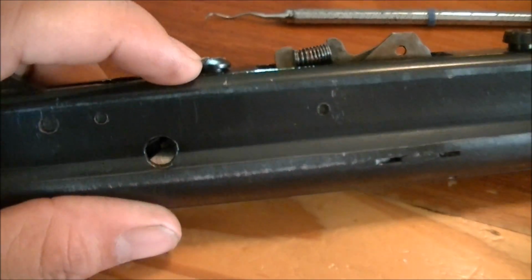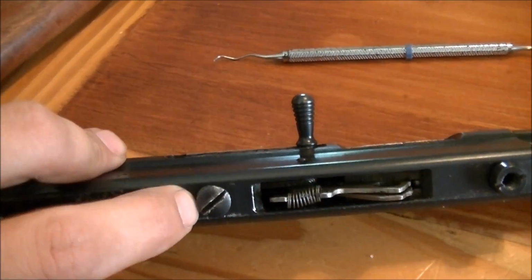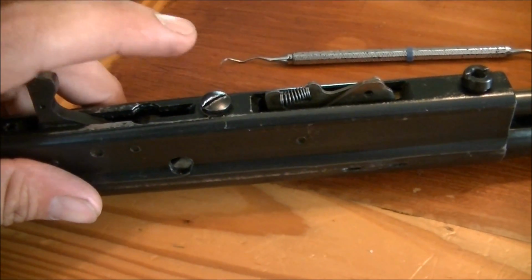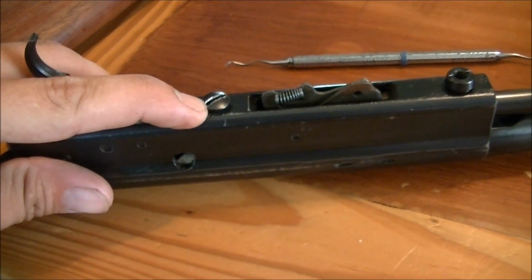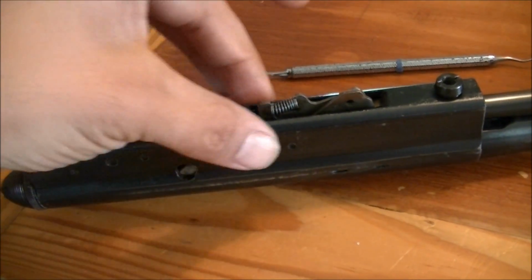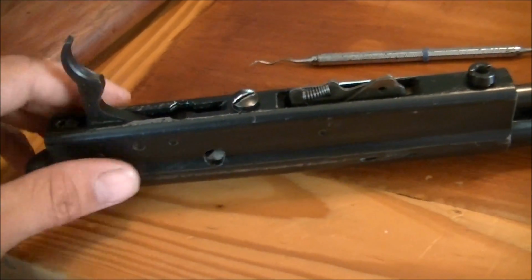I've got this tightened down. I actually lengthened the spring just by a hair to give it a little more pressure to push on the sear. So that's one thing, my honest opinion is leave that alone, because I guarantee you, unless you are very, very careful, you will strip your threads without even realizing it. The threads are so fine on this receiver, and this is pretty soft metal, it really is. We're just talking about a 22 here. It'll booger them threads up, trust me.